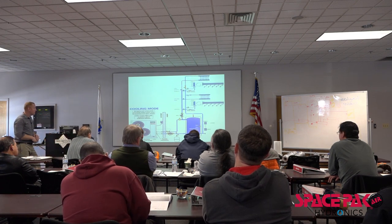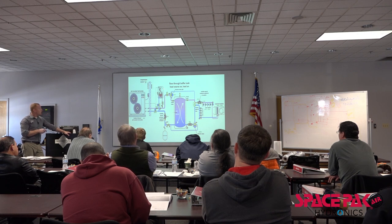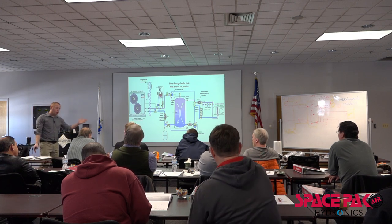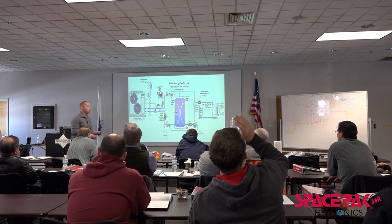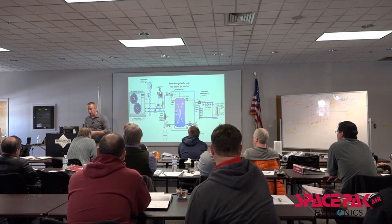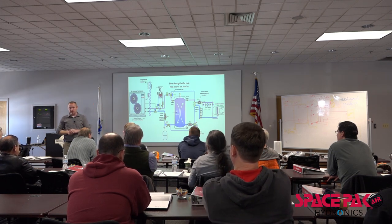Heating mode, cooling mode, a couple different applications. This shows a little layout of how, through some motorized valves, we can call on a boiler and run them at the same time. Our SSIC control has a cooling mode, a heat pump only mode, a boiler only mode, and then a boiler help mode. Regardless of where we're at, generally speaking, running that LAHP, our low ambient heat pump unit, will be more efficient than firing up any fossil fuel.